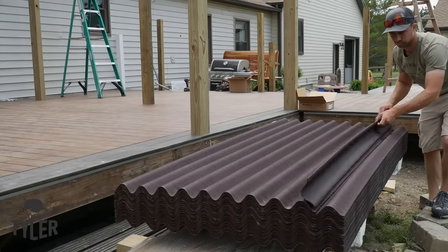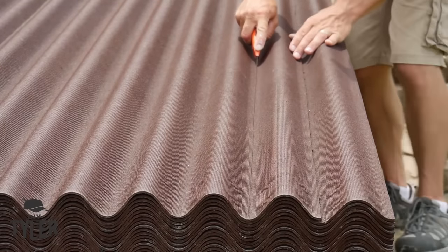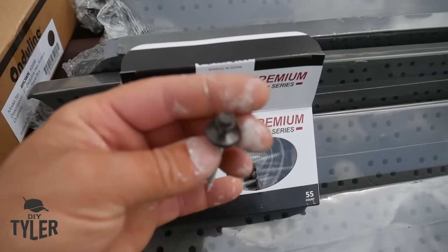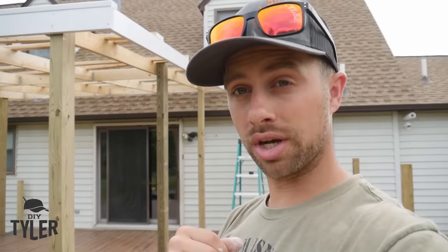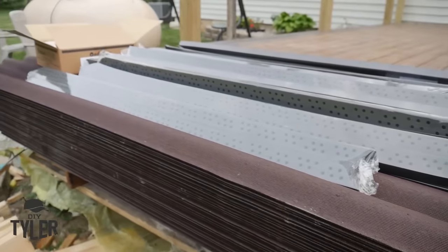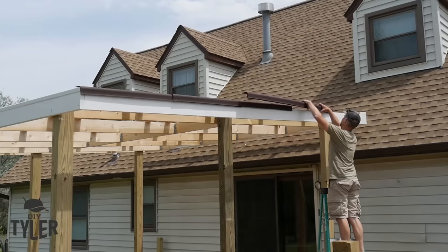We'll put the panels up and shoot a couple of screws to the side, then the panels go on top. I laid out the purlins so we hopefully won't have to cut any panels. We're going to do a one-third overlap — a very heavy overlap — because this is a relatively shallow pitch and we want to make sure no water gets through, along with a two-corrugation overlap as well. That should work out perfectly so we have the embossment lined up for screws nice and straight across the pergola.